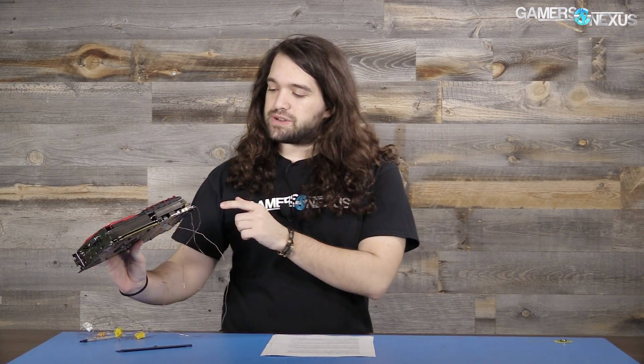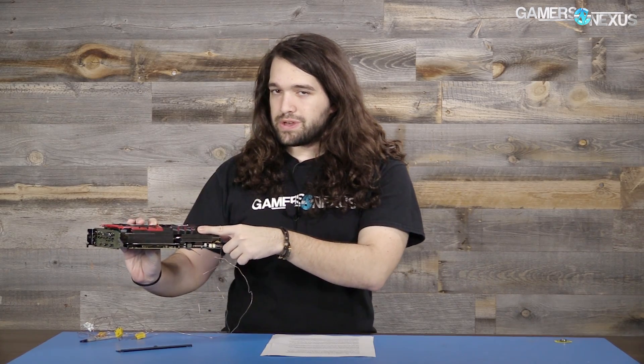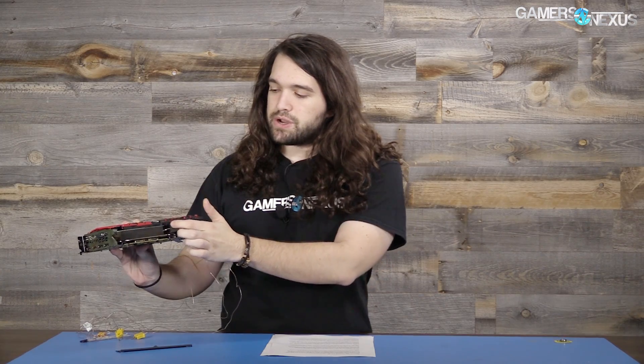This generation of GTX 1080 Ti cards has gone big. We have the Gigabyte 1080 Ti Extreme to review next already here, and that's multiple slots — and this one is fat too. It's got not just the normal Twin Frozr cooling design with the dual axial 100mm blades, but it also has a much fatter fin stack and denser array of fins. The fin density and fin count are both greater, spread across the entire card with partitioned base plates. It's a big card that can deal with a lot of heat, even though the 1080 Ti doesn't necessarily output that much, even compared to a 1080.